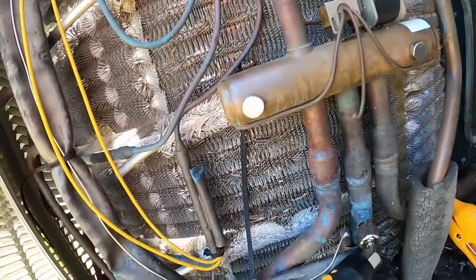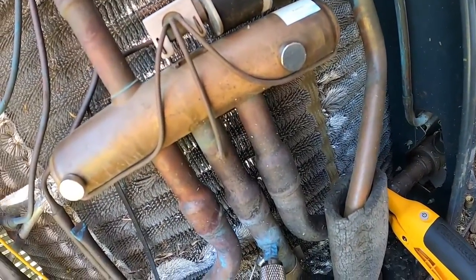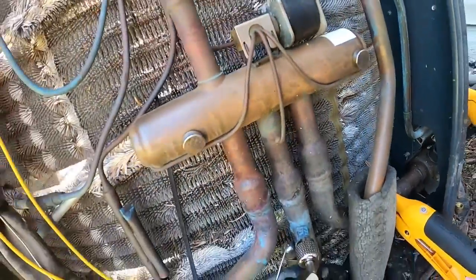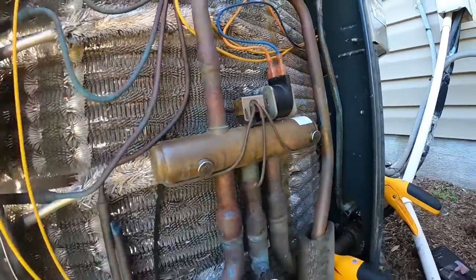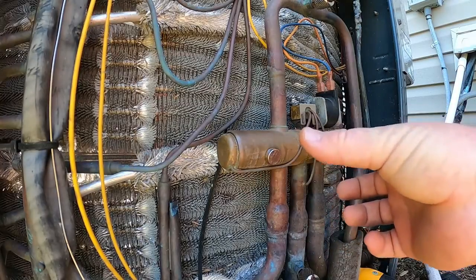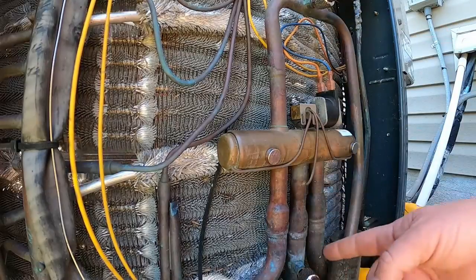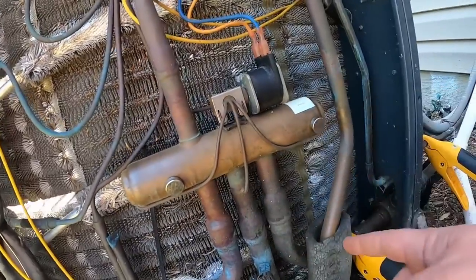There you go — see them shift! Now they're on the other end. So you can use those magnets on your reversing valve, and see them move back when it shifted. If it's in a mid-shift or not making a full shift, the magnets wouldn't go all the way to the end — they'd maybe stop right in the middle. Which means if you're not making a full shift, everything in here is not lined up right.